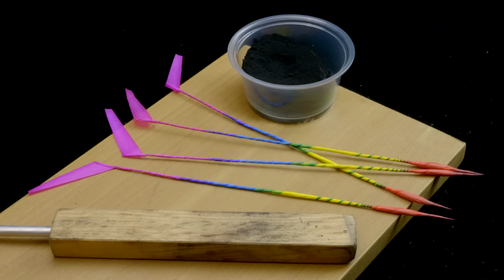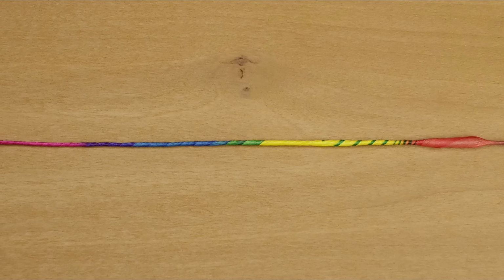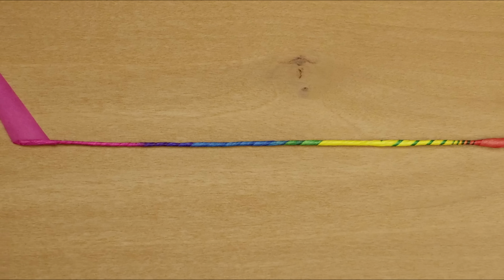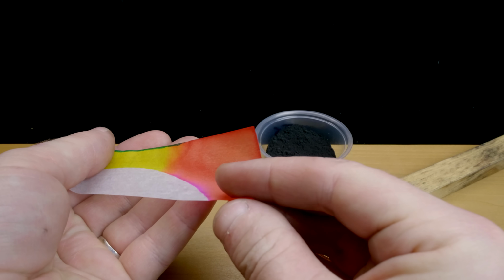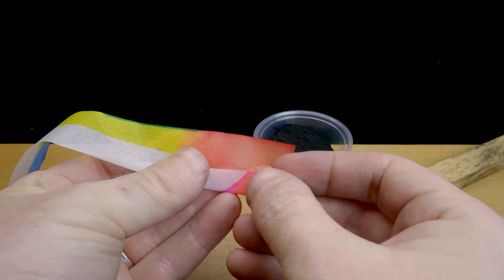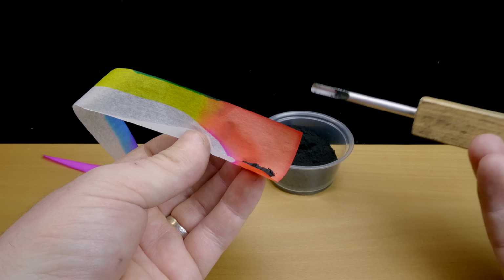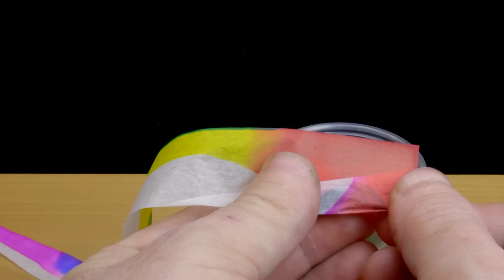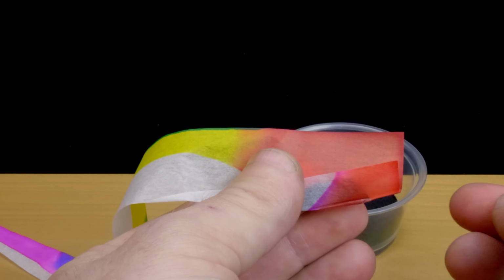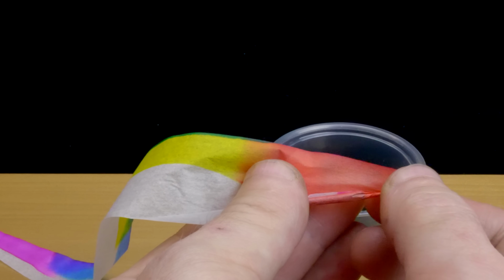There are 4 distinct sections of a Senko Hanabi. The papers that are used for Tsutsui Tokimasa sparklers are dyed with a traditional color pattern which helps to identify each section. The head, identified with red dye, contains all of the powder, about 0.08 grams measured with a small scoop. The powder is placed into a fold, and starting from the corner, rolled up like a sausage, while the neck of the sparkler is pinched tight in the other hand.